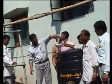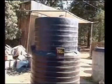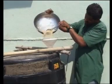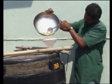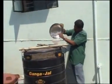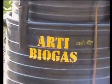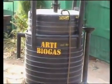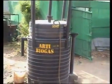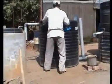This pipe serves as the inlet pipe. There is no need to fit an inlet pipe to the fermenter vessel — we now have the inlet pipe fitted into the gas holder. The biogas plant can be installed at any convenient place, but this place should receive direct sunlight. Clean and level the ground and place the large fermenter vessel on it.